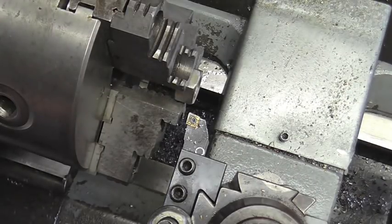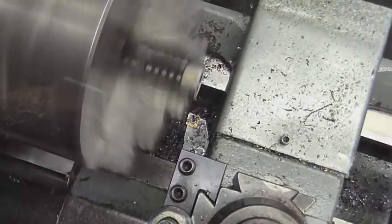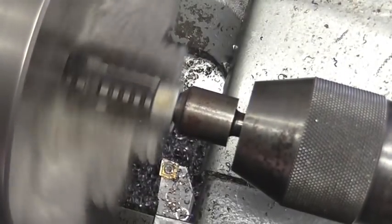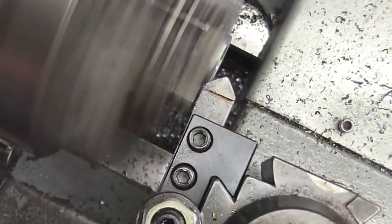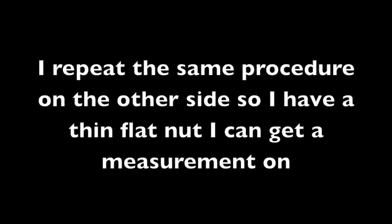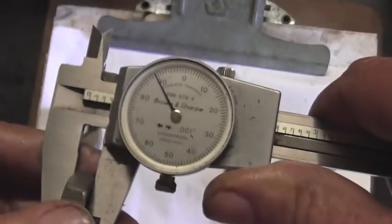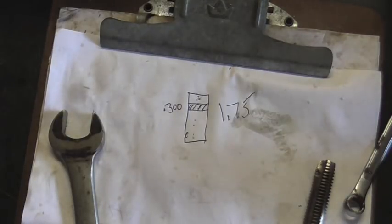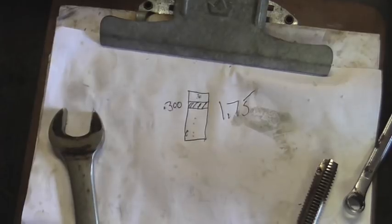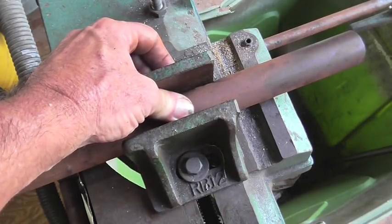It's pretty hard but it's cuttable. It's a little bit thinner anyway. Let me go ahead and get a measurement on that and we'll plug it into the drawing. That's 290 — we're just going to call that 300 thousandths. So if that's .300, it gives me an idea of how fat to make the top and the base. I'm going to cut this thing oversized so I can put it back in the band saw later and lop off the two pieces as needed.